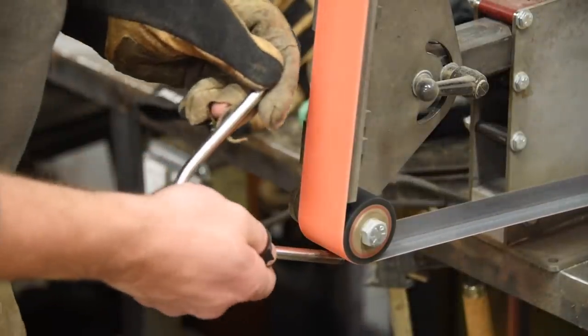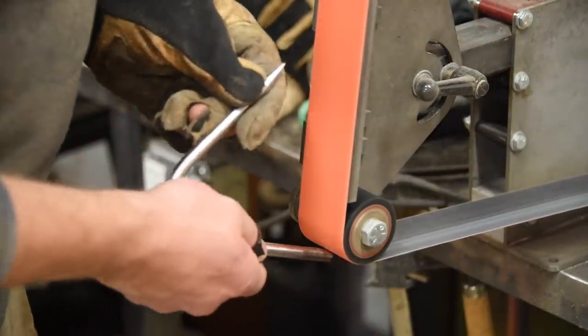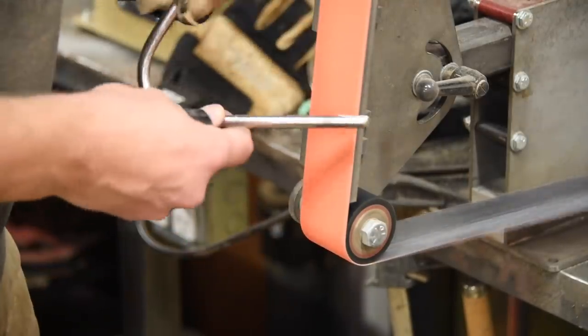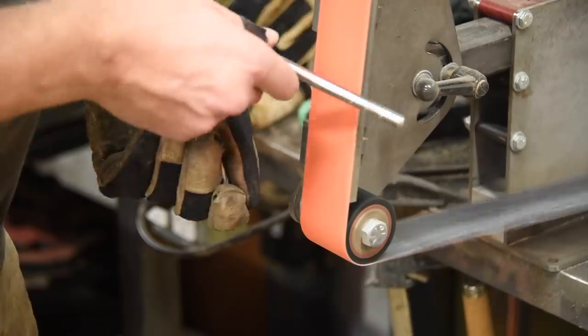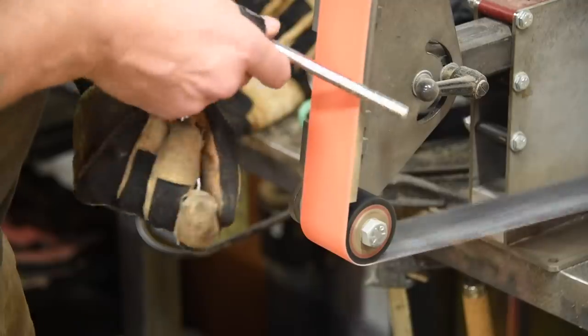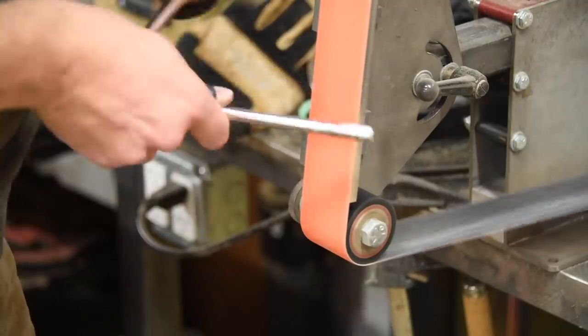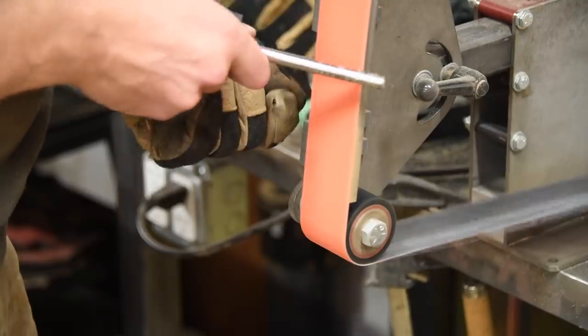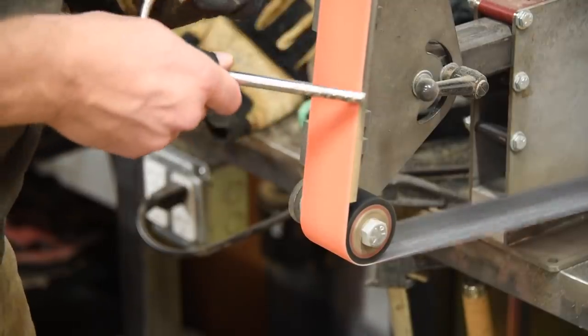The last thing I've got to do is grind a little flat spot here just so that I can drill a small hole through it. I want to place a screw through the steel into the handle so that it can never come apart, even though I'm going to epoxy it too. I'm also just going to scratch this up with some grooves so that when the epoxy pours around it, it'll keep it from sliding out — you don't want a smooth surface here.